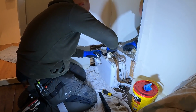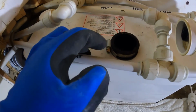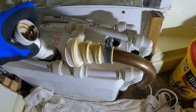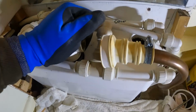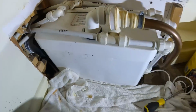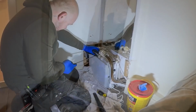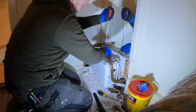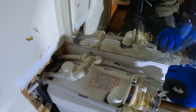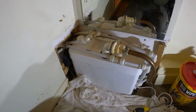Jubilee clip first. So Jubilee clip on, as I've always said, make sure the nut is accessible, the actual bolt bit is accessible, so it's this side, and then we'll pop that back down, tighten this up, pop that one onto there, tighten that up and get the fuse back in and give it a test. Hopefully it's okay. So that's all tightened back up now. We'll pop the vent cap back on there. Just going to pop the fuse back in, fire it up, and see what's happening.